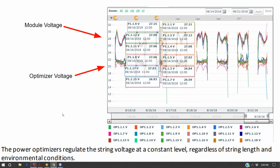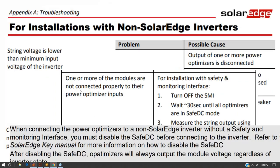So drawing power off of a shared DC bus can give you the same impact as a shaded SolarEdge array. But that is why you use those individual voltage regulators on the rooftop behind every module, explicitly to mitigate the impacts of shade, so that some of the array can be shaded and the rest of the array can stay on. It used to be that without those things, the whole array would turn off, but you use SolarEdge to keep the array on.